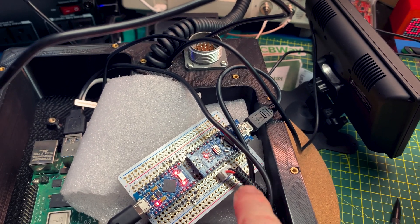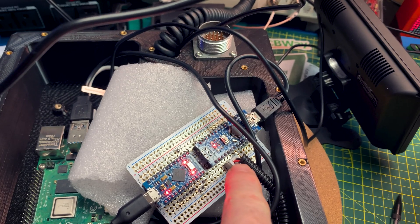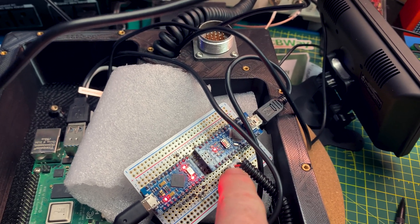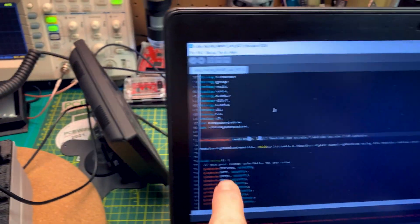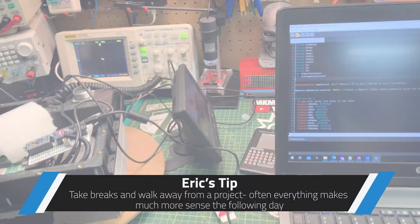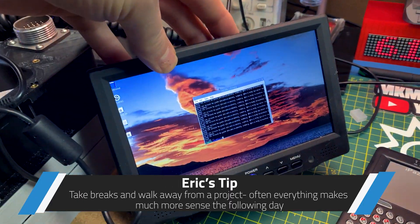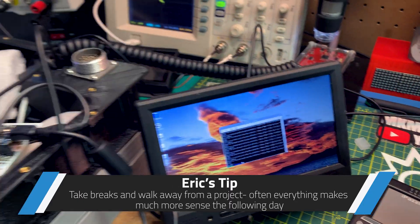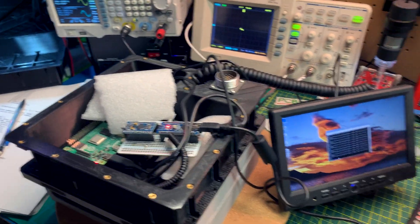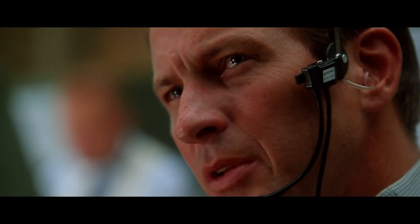The only thing I can think of with the display is perhaps I've got RX and TX flipped on the display itself — it's quite possible they're wired to the wrong terminal. So I'm going to swap them in the code; I don't want to resolder. Well, that didn't work — that just caused a refused connection internally when we run the DSKY. So putting it back and I'm gonna keep looking.